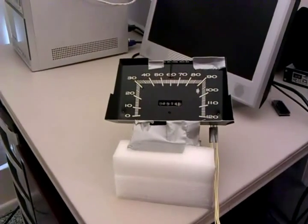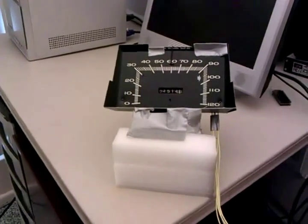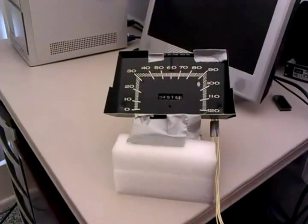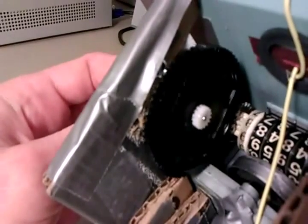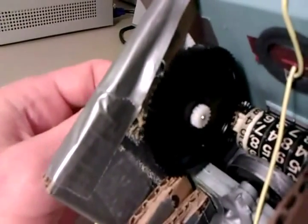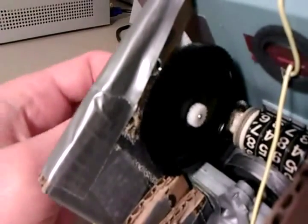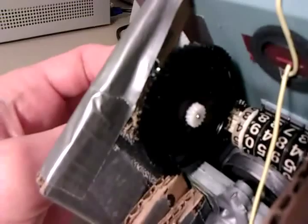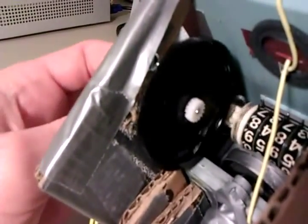Alright, so this is my odometer that is hooked into a stepper motor so it can be remote controlled by my computer. It's really dark, but there's this big stepper motor here that's tied into the fractional miles gear, which is then hooked into everything else. So you spin one and they all spin. It's just a really simple motor that goes forward or backwards and it turns the odometer.